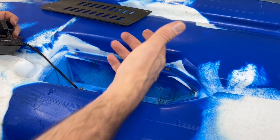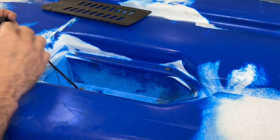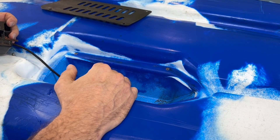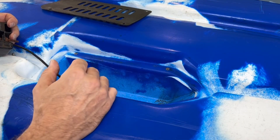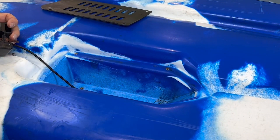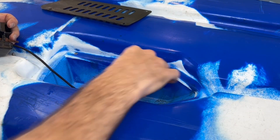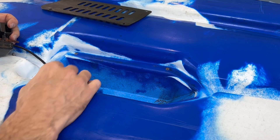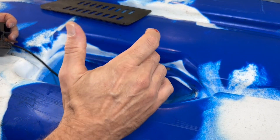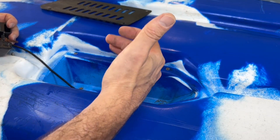You want to feed your cable through the scupper hole. The transducer you use here is most likely going to be a downward-facing transducer. You can do side-scan but you won't get the full benefit of 180-degree side-to-side view because it's recessed down. It's still possible but you're not going to get the full benefit. If you're going to do side-to-side, it's probably worth using an arm attached to the accessory rails that you can then drop down.